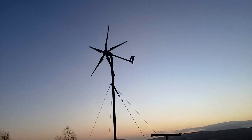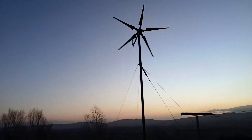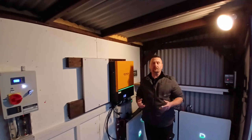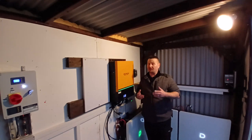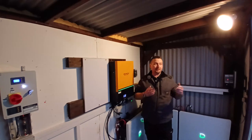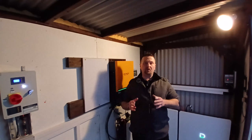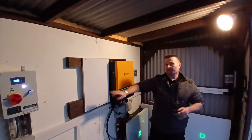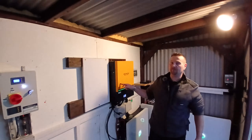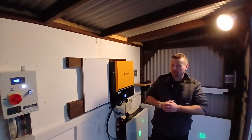Typically enough, the wind has died down — beautiful sunset though. Now that the turbine is running at 48 volts instead of 24, it also means it's got twice the load on it, which means it's going to take more wind to get it spinning up faster. Seeing how the wind has decided not to play ball with us today, we're going to have to do a follow-on video and get some updates on power readings. You might have noticed we have a new section here, and that's because we've been having some issues with the MPPT in this — that's going to be the latest stage of upgrades to our system coming in the next video.